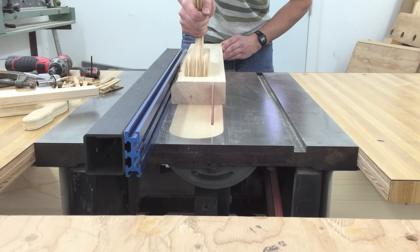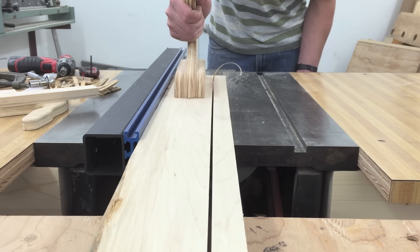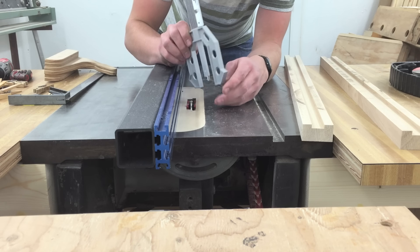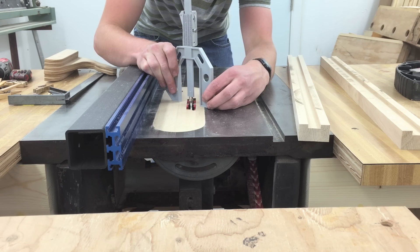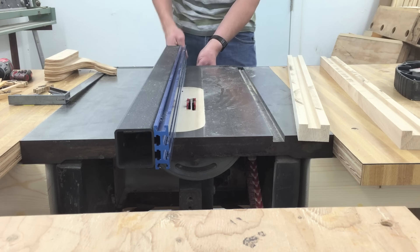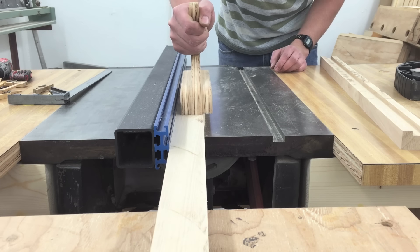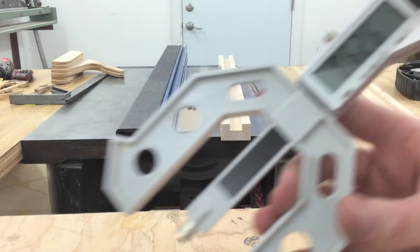Now I am making a wood support to go behind the lead screw. This part is one and three-quarter inch by one inch and the rod sits in the dado that I'm cutting. I want to set the final height of my dado blade but I can't get my gauge in — but this is the advantage of this fence system, because I can just move it and when I bring it back I know it's in exactly the same place. This dado is cut to three-eighths inch deep, which should leave five-eighths inch below the dado. I use my handy depth gauge to measure that, and perfect.